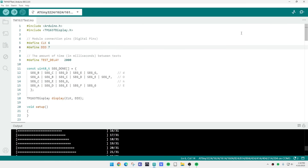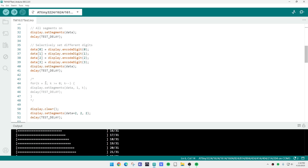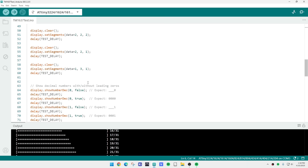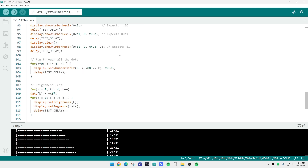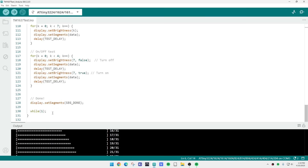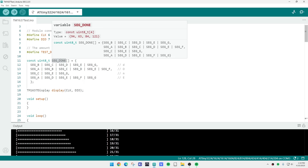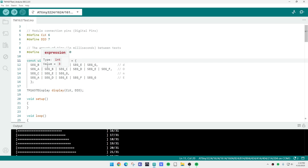We can look at the demo program. They set up a segment matrix for all the segments. Here's where it sets the brightness, does on/off test, and then display segment — segment done. Remember it displayed 'DONE.' So segment done is defined up at the top — it's all of the bits that you want set, and it spells D-O-N-E. So there you go.